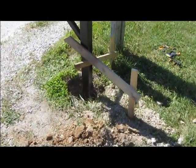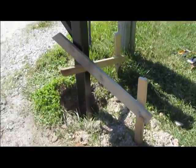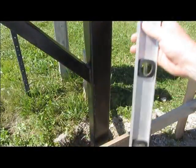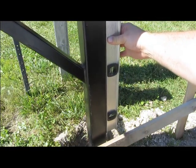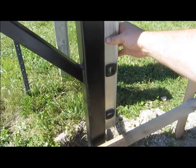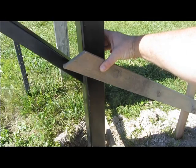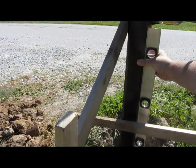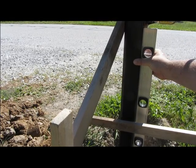I have made sure the stakes are placed in the ground very securely, and I have the cross members screwed to the stakes. I will now take a level and place it on the side of the post. I will move the post until it is level in one direction and clamp it at that position. I will then level in the other direction and clamp my cross member once I achieve that level position.